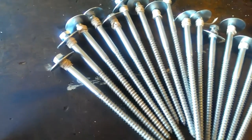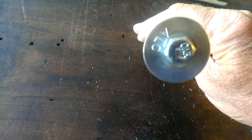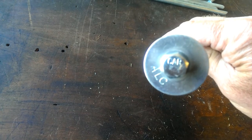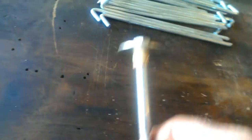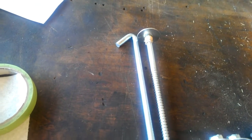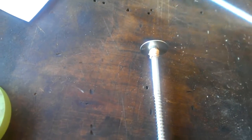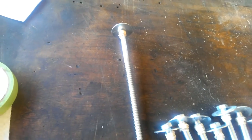What I did is I went down to Home Depot and got these lag bolts and some washers. They've got a little 9/16th socket head on them right there. You can see they're a little bit shorter than what Kodiak gives you, but the grip strength and the ease of putting these things in is absolutely ridiculous.